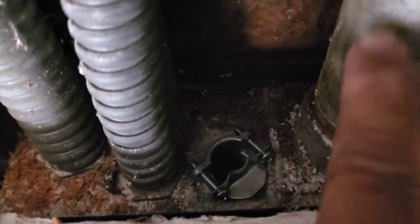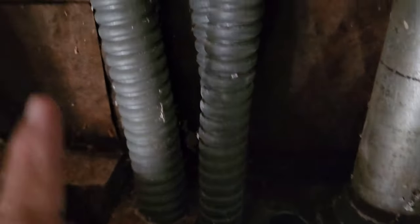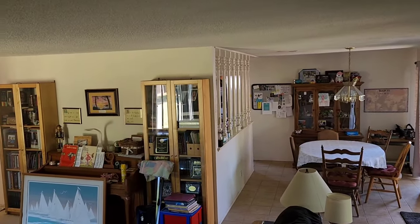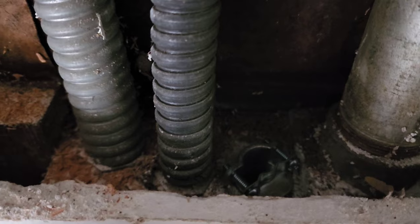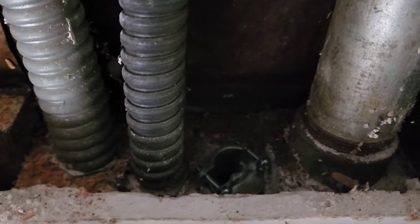Okay, guys, we've got our connector in the box. Our connector's in. You can probably see it right there. Now I'm going to pass Vinny up some wire, and he's going to pull it all the way across over there into the kitchen through the attic. We're going to put a hole where the microwave is, up in the cabinet above. So anyway, that was hard. We're trying to do this without taking the meter off, because the meter's locked and we don't want to have to call and have them come and unlock it. So we're just being cautious and doing it with the meter on.